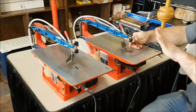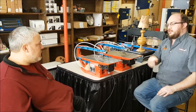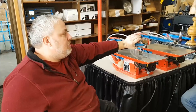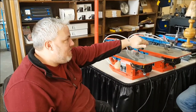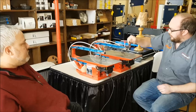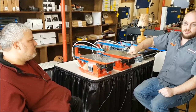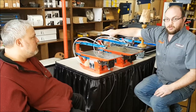Now Eric, when you don't have a machine like this with the tensioner at the back, how do you tension it, like on the Excalibur? On the Excalibur, there is a knob on the back that is not your tension knob — your tension is simply the little duck head on the front. You flip that and you're done. All the other big box machines work just like the Hegner; they don't have the lever on the front, only the tension knob at the back. What I do like about this style is that when you change your blade, there's a positive stop that brings you right back to the tension you were using before. So once you have that set, using the same blade and similar material, you don't have to fool around with it.